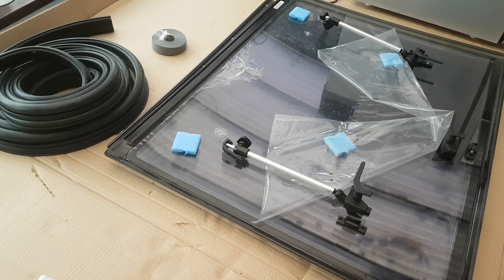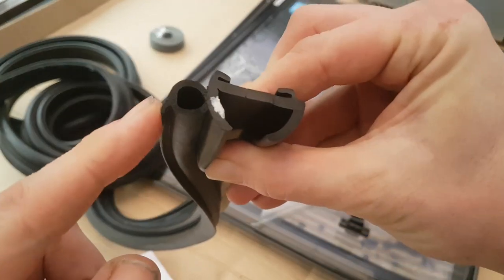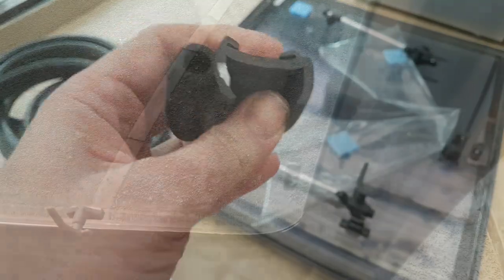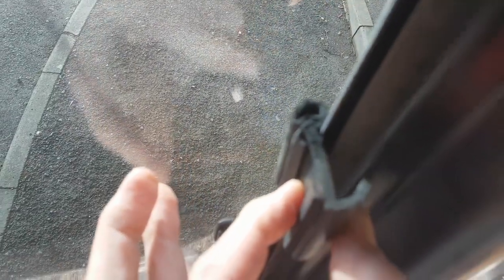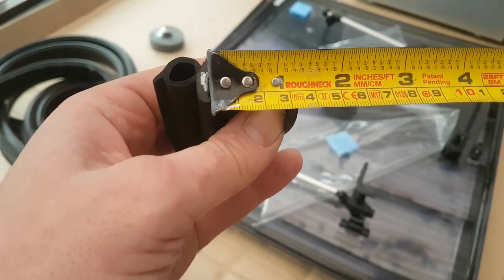When we've cut our reveal — a 560mm wide by 500mm high cut in our metalwork — we then need to clad the inside with some timber, some woodwork of appropriate thickness, and then put our finished inner board on top. The total thickness of all that should be within what's permissible by this rubber. The rubber goes around the reveal — this is the outside so it'll push against our window — and you screw or staple it around the woodwork. This piece here seals against the external paintwork and the other side fits over the interior trim. The total width of that internal section is about 30mm, so a desired wall thickness of around 30mm will be ideal.